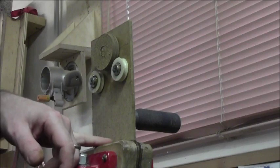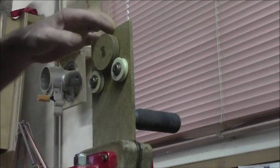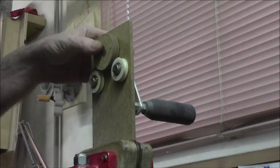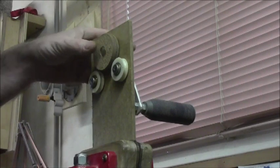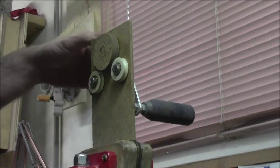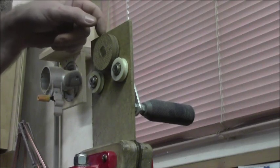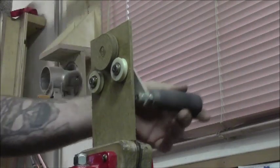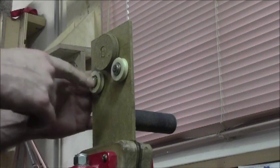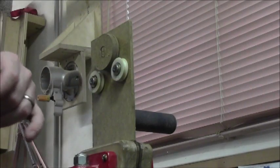So I made this little contraption here — you can find plans for it on the web or actually buy them from some luthier supply shops. All it is is pretty simple: I made a round wheel and cut a slot into it. I got a piece cut to almost round, chucked it up in the drill, got it rounded completely perfect, then took a hacksaw blade and rested it along here while it was spinning in the drill press — it created a nice channel that's just the perfect width for the tang of the fret. I attached the handle and two rollers — just off a patio door — one fixed and one adjustable up and down through a slotted hole, which gives different radiuses.